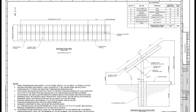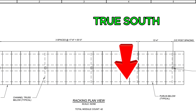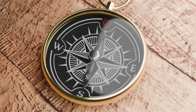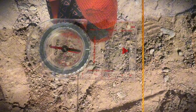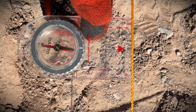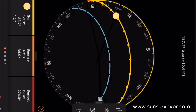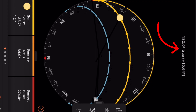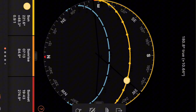Let's jump into the plans and I'll walk you through some of the key details for context. The rack faces true south, not magnetic south. True south is based on the earth's axis and longitude lines, and that's what gives us maximum annual energy production here in the northern hemisphere. When preparing to lay out my posts for the rack, I use a string line to approximate where magnetic south is, but I need to make an adjustment. So I downloaded this Sun Surveyor app — it uses the magnetometer in your phone and makes an adjustment. You can see on the right hand side I'm making an adjustment by moving my phone to 180 degrees, that's true south, and it shows that it's adding plus 10.64 degrees to magnetic south to get that true reading.